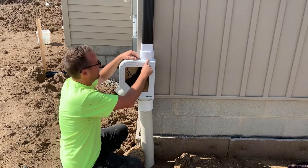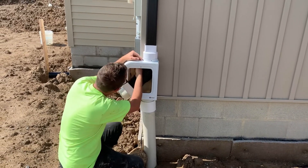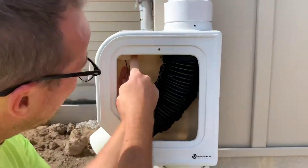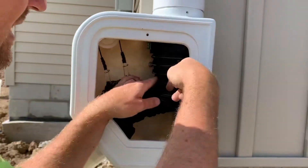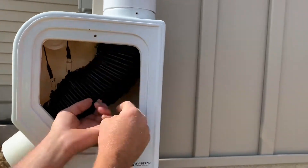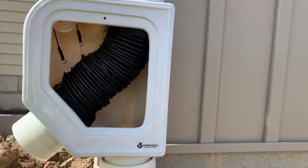We'll put our Phillips head screw in there and then put the plate back on. We're going to make sure that this string is mounted around this pulley — this is what causes this filter to flex down. So as rain comes down, it weighs this down, it flexes, and clean water pours out through this filter screen while debris passes straight through.